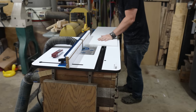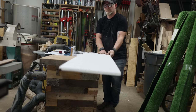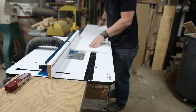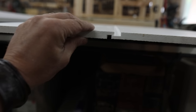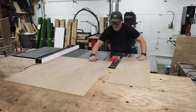After ripping the panels in half, I took them over to my router table to create a rabbet on one side. Then I adjusted my fence further out by one eighth of an inch and ran the opposite side through it — this makes one of the grooves smaller than the other. When stacked in the right order they overlap each other, giving me a one-eighth-inch reveal and allowing water to run down. We're pretty much making nickel gap siding — it's like shiplap but has that cool reveal and is still watertight.